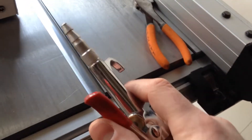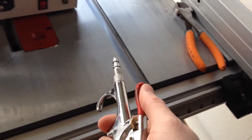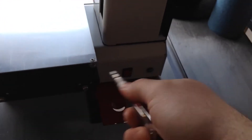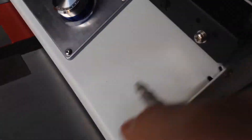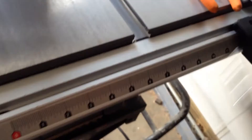Since this is my workshop, I have my compressor over in the corner with air running out to this hose and nozzle, so I'm going to go ahead and blow the thing out. Next I'm going to take some shop towels, rip them down into little strips, and run these along the X, Y, and Z axis to make sure all the rails are clean and free of debris before I lubricate.